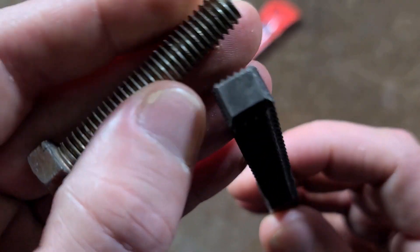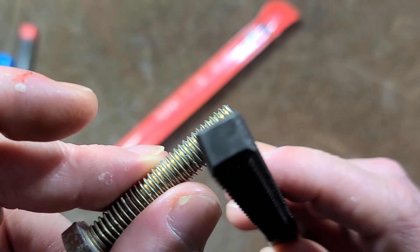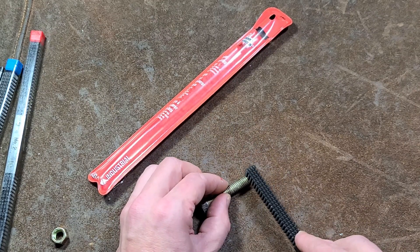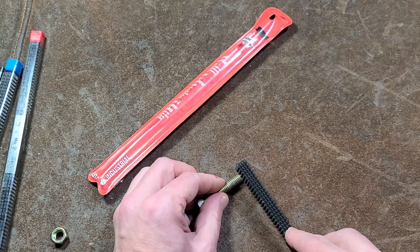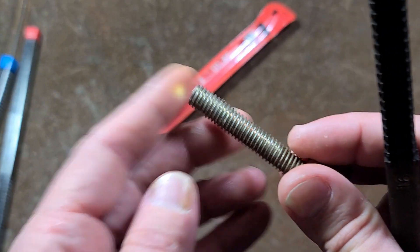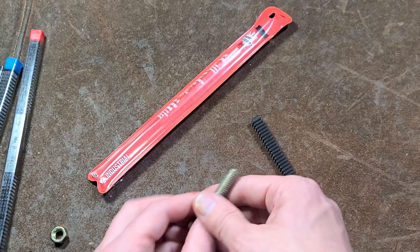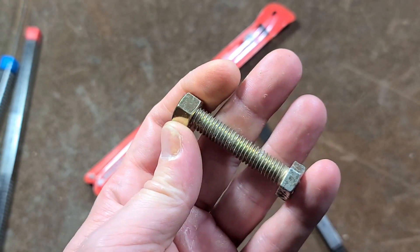Part of the issue with these is that when you're filing, you can see just a little bit of light under there. These are designed to be a little bit short — they don't reach the very root of the thread, although they can work pretty well for cleaning out threads. This is moving pretty smoothly through here, so it's not catching a whole lot of burrs. These can also be handy if you have a fastener with a bunch of threads sticking out and it's really rusty — you can use one of these to clean the rust right out of the depths of the threads. It does work pretty well.